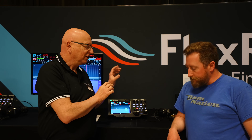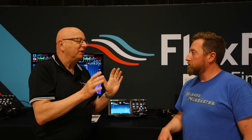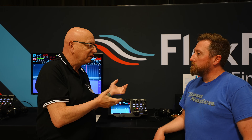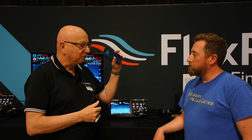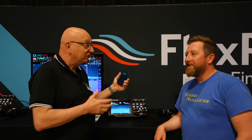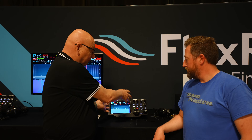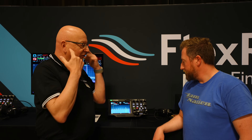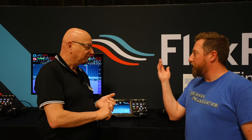We use really fast computers called field programmable gate arrays in the radio. In the old Flex days or with other SDRs, a lot of the processing is done in the computer, so you need a high-end gaming computer. In the Flex radio design, my iPhone is more than powerful enough — because all it has to do is play this movie, feed audio, listen to my microphone, and detect when I hit the button to talk. Control inputs are nothing on the bandwidth.